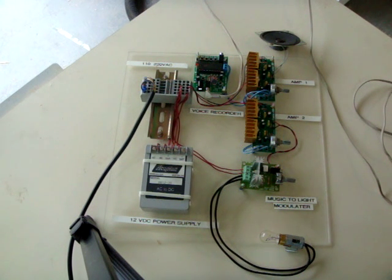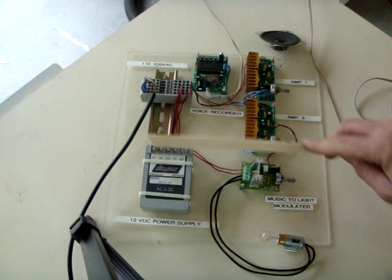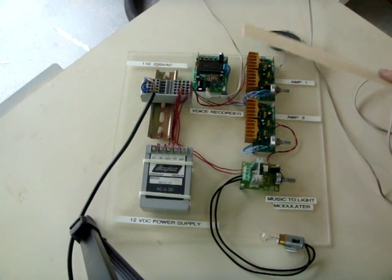It goes together real well. You can solder the thing and have it up and running in a simple afternoon. You follow the wiring. You come out of the 110 wiring input to the 12 volt power supply. The 12 volt runs the power for the voice recorder and the 2 amps.